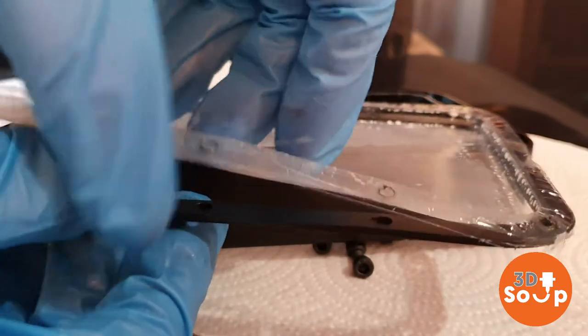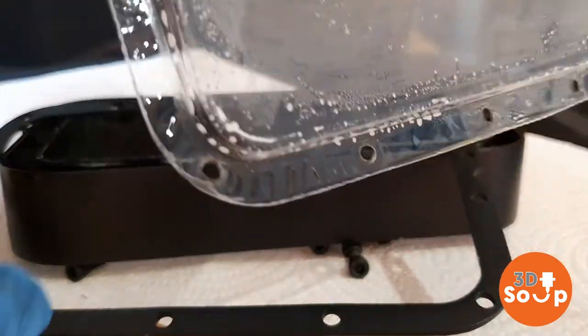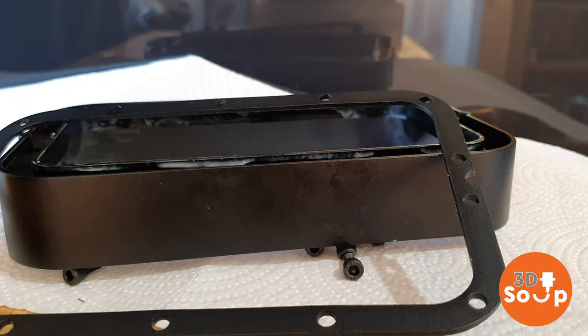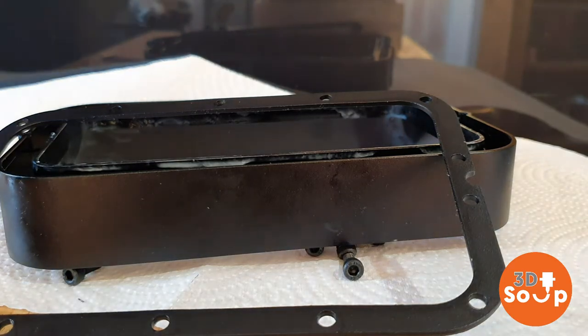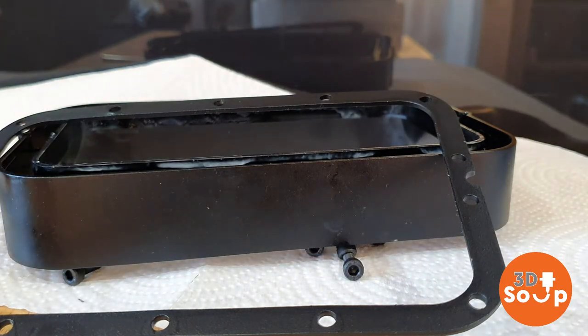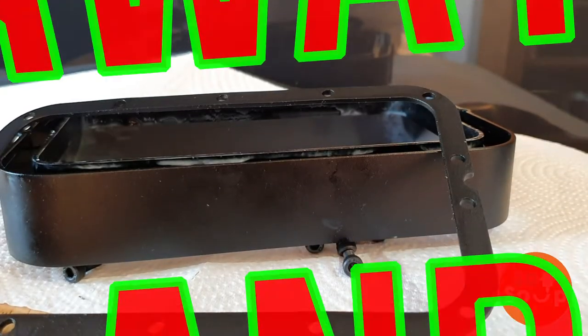As you can see, this film is fairly worn out - it's got scratches, bits of resin, and little holes in it. The more you use it the more you're likely to get failed prints. If you're shining UV light through a piece of film which has imperfections or little bits that can't quite shine through, you're going to get detail that doesn't pick up. Pieces of the resin will cure in the wrong place or not at all, and eventually it's going to break away and you'll get a load of failed prints and ruined models.